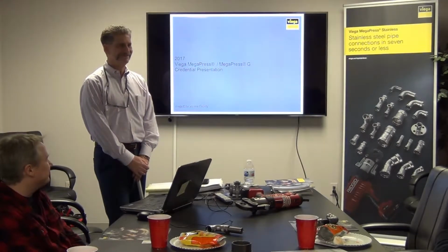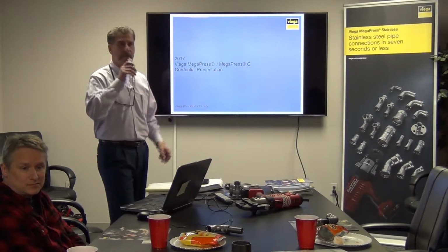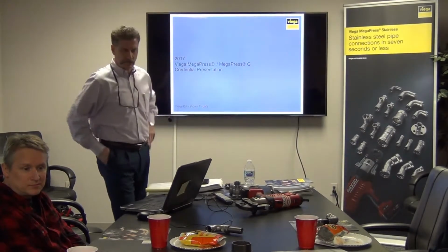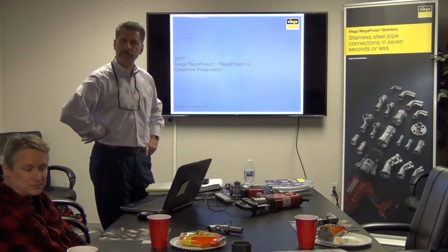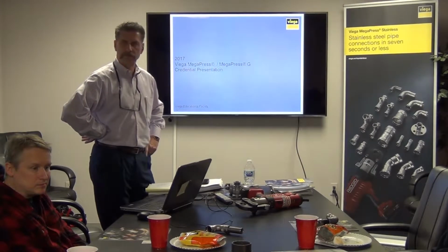From an inside sales perspective, some of the questions that you get, does anybody want to share with us any of the common questions you get? Yeah, like how long are those seals going to last? That's a great question. Once we encapsulate, like we were pressing in this room, we're going to capture whatever is in the air forever around that sealing element. So the sealing element is going to last longer than the pipe because the only thing that could attack it is what's in the line.